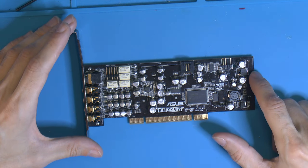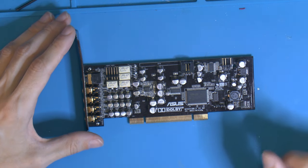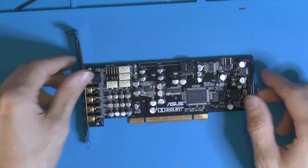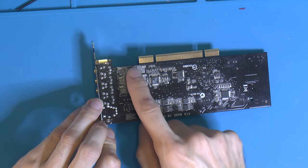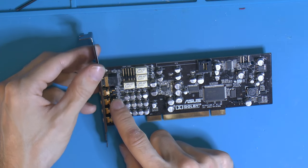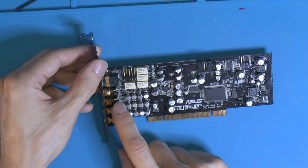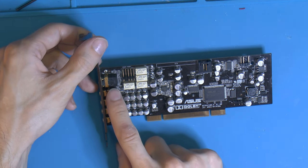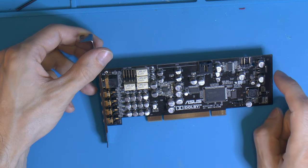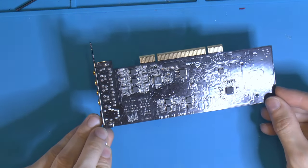The fault was fairly simple, a linear voltage regulator. If you're better than me, you probably know those part numbers, and we'll check that. I didn't know that initially, and I actually figured something was wrong with the op amps, the 5532s, because I got audio out of these, and with active speakers they sound fine-ish, but with the headphones they really sound bad too. So that threw me for a loop in the beginning. But yeah, the culprit was this 8 volt voltage regulator. Once that was replaced, the card works just fine.